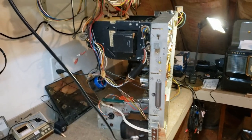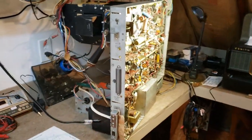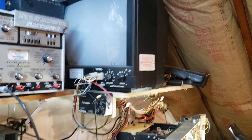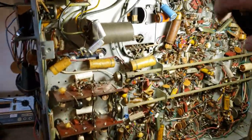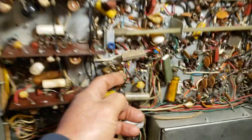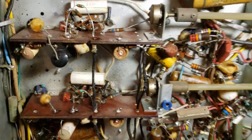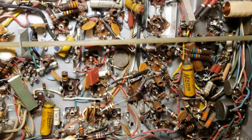The next step was to connect it to the test jig using my homemade CT100 adapters — I haven't used them since 2003 when I last did one of these sets. I did a Shango-type resurrection. Almost every one of the peaking coils — these are DC feeders and peaking coils, there are about 10 of them — are almost always open, so I jump them out to start with just to see if the high voltage and deflection components are okay. I brought it up slowly on the Variac and I did get high voltage and it ran pretty good.